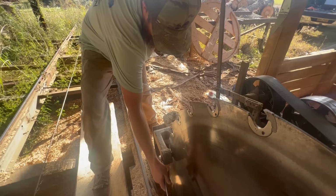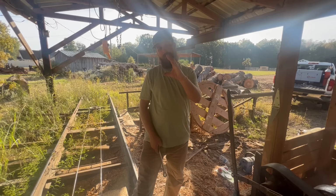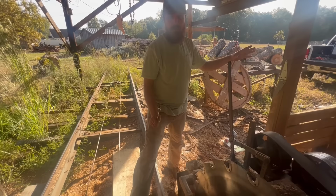But you have to run a wrench. I got to tighten these by hand, and you can get them close. But the way this saw is cupped sort of like this towards the log, and when you hit the revolutions that it's hammered for, which mine is 525, as it hits 525 RPMs or gets close thereabout, it will start to open and flatten out. The only way on this old style, you get them close right here. It's near where it needs to be.